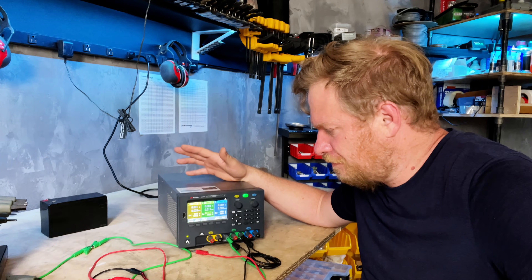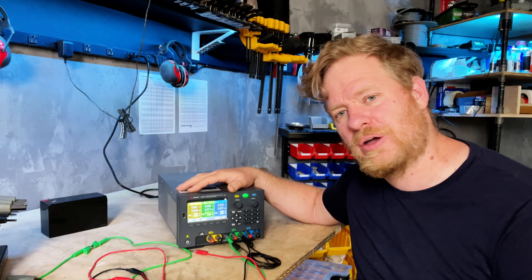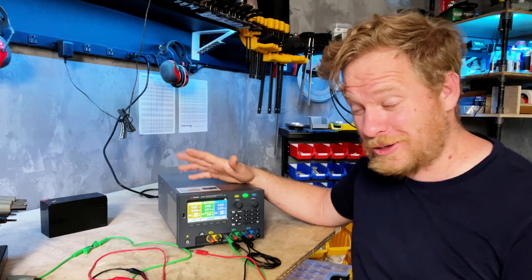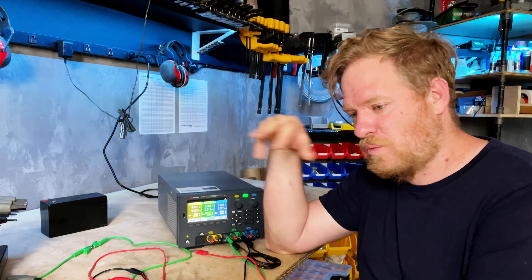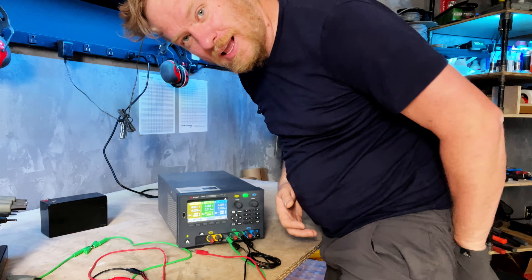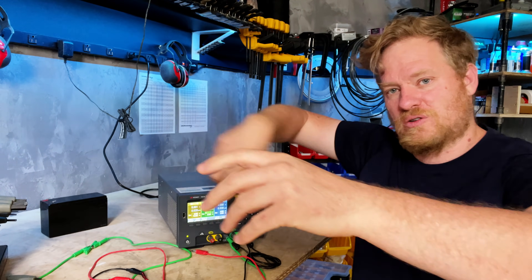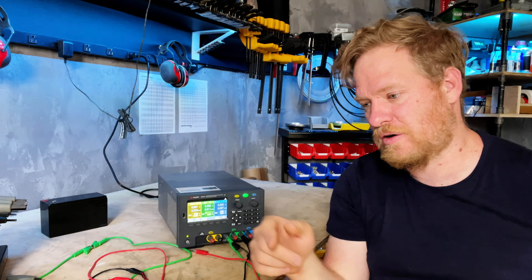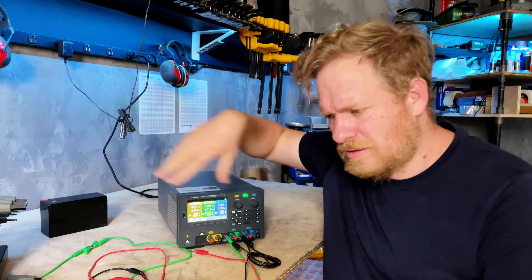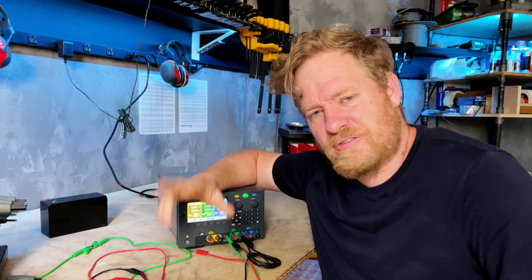This has all been a little bit scary, to be honest, in operating this thing. When I was first doing it, making changes and stuff, I had someone come down to the shop so that I wasn't here alone in case I had any issues. The real danger is that you get shocked and have a heart attack. The other thing I did is really make sure that when I was running anything, or there was any danger of high voltage, I was only working with one hand — that's why you see me in the video with one hand in my back pocket. That's a safety thing so there's no chance of a circuit going through one arm and across the heart. But the more I worked with this, the more I became convinced that we did a pretty good job insulating everything and there wasn't a lot of risk.